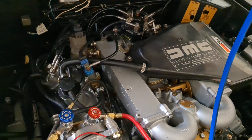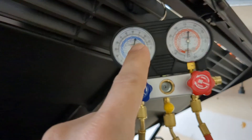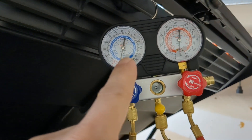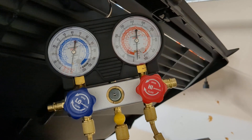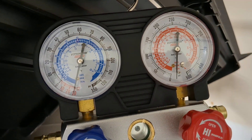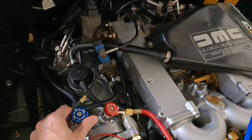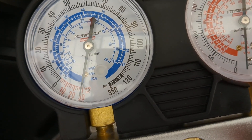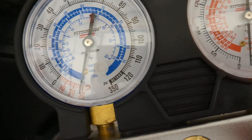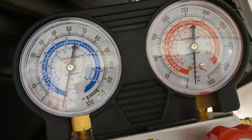Now I want to compare the vacuum in the car to the vacuum in the hoses. If it's equal, that's perfect. If it drops just a tiny bit, that's okay - I've done this two or three times while testing and the first time it didn't drop at all; this is just a demonstration. But if the gauge dropped significantly, that would mean I lost a lot of vacuum overnight and I have a leak. Now I'm going to open up my low-pressure side and watch what happens to the vacuum gauge. It dropped a tiny, tiny bit - that's because I've done this three or four times while getting ready to make this video.